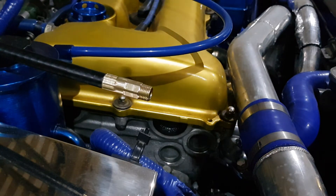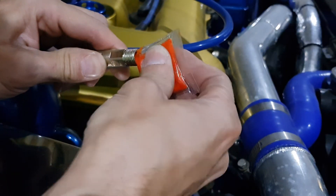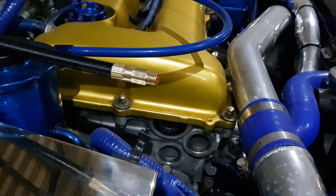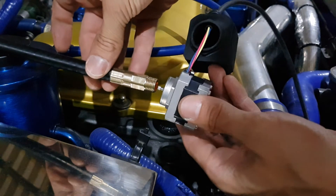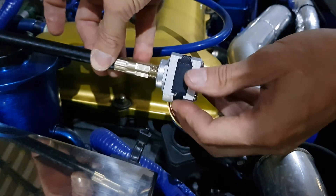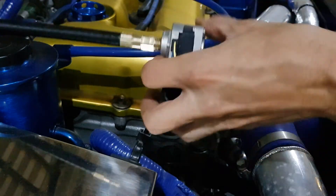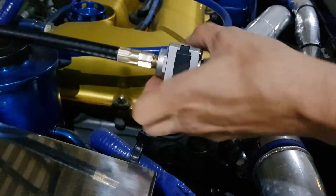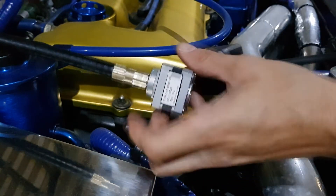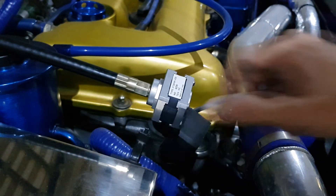Once you've got that in, you can work on putting your motor onto the actual extension shaft. Put some more grease down into the end of that tube, then just screw your motor gently on the end. You can use threadlocker on these threads, but I don't know if it's 100% necessary — because you're attaching the motor to a bracket or something solid, the motor won't be able to turn around and unscrew itself anyway, so I think it's optional.